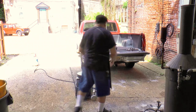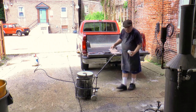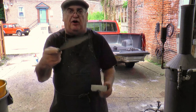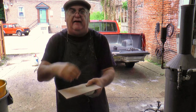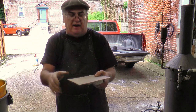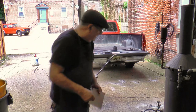One other thing is the plinth here, which I had in the regular oven — I dried them out. This is ordinary cardboard. I'm going to cut it in half. When you're ready to fire up, you put a piece on like that and stick the crucible on top of this. This of course burns up and causes a layer of carbon which won't stick to either part, and that helps quite a bit.